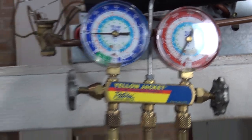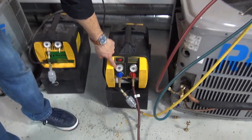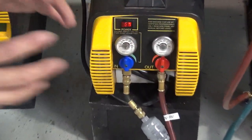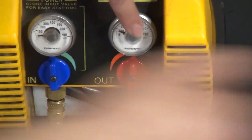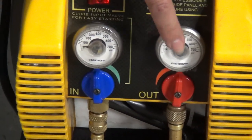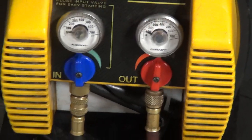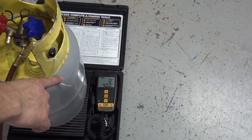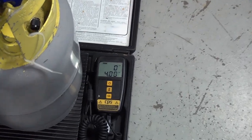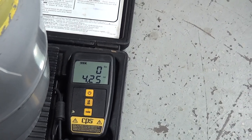Follow me over here. As the pressure is going down, this gauge by the recovery machine is also going to go down. On this one — this is the pressure of the recovery tank — make sure this one doesn't go over 200 PSI, 250 at the most. Try to keep it down. Follow the red hose — it goes from the machine to the recovery tank. Look at the numbers: we started at zero ounces, zero pounds. Now it's four-something ounces — it's recovering the freon. Let's go back to the gauges.